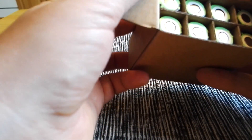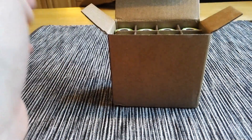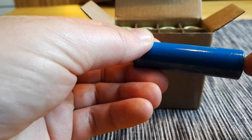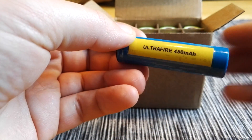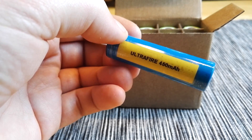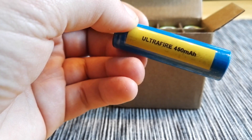As many know, it's hard to find good 18650 batteries on eBay, AliExpress, and so on. Much of the batteries are fake in capacity, like this one. This was an UltraFire branded 3000 milliamp-hour battery, but when I tested it I only got 450 milliamps. It's a known problem that they brand their batteries with higher milliamp-hour ratings, and when you get them, they are bad.